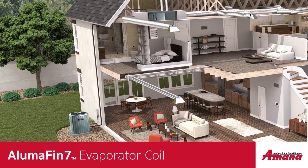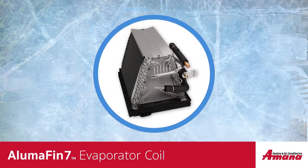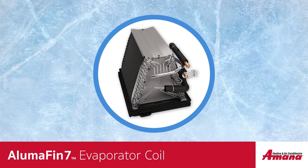Its main job is to prepare refrigerant and then pump it through the tubing you see connected to the unit. This refrigerant travels all the way to the evaporator coil inside your gas furnace or air handler. When the refrigerant arrives at the evaporator coil, it gets very cold. In fact, the evaporator coil itself gets very cold.